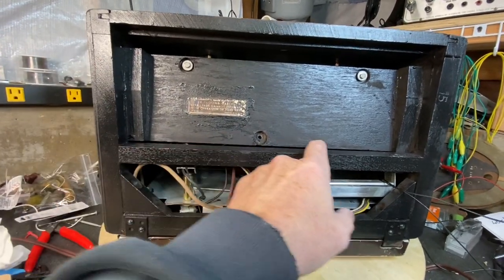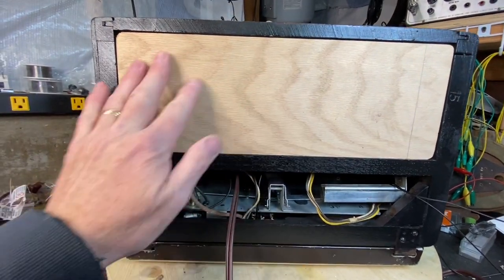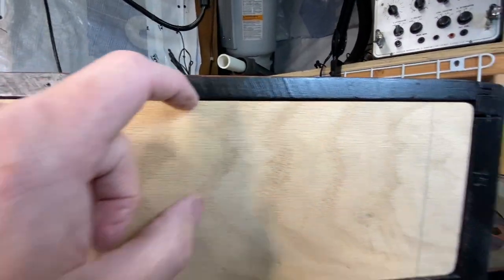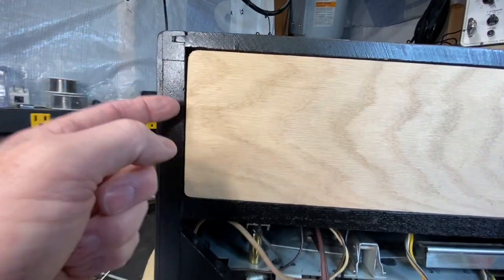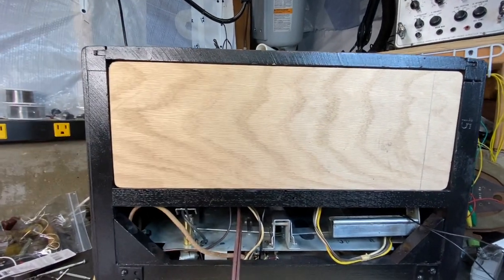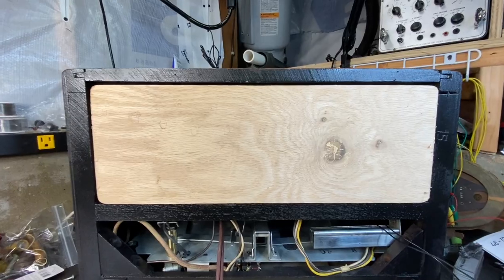This particular radio was missing the antenna in the back, so I'm going to wind a new one. I made essentially a bobbin that fits in there — it's the right size, three-quarters inch thick. I do have to trim it a little bit though — I've got a gap enough for a wire, but I need a gap on both sides enough for two wires, so I need to trim off maybe a sixteenth or a little more on both sides, and then I'll start winding the antenna.